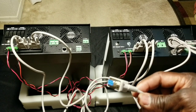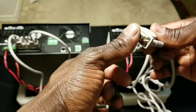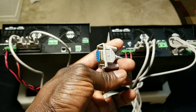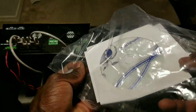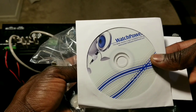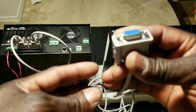This goes to the serial port of the computer. You can buy a box where you connect the male to the female, and the output is going to be an Ethernet cable — maybe Cat5 or Cat6 — that you run to your computer, just like how you connect the Classic charge controller. You can then run the WatchPower software — the latest version is available online to download.